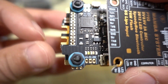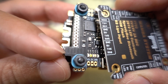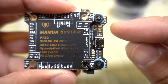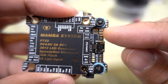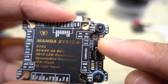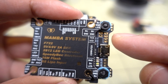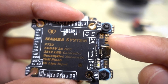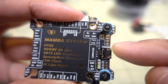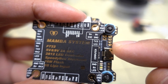The antenna — it looks like a little squiggly line — is the antenna for the Bluetooth adapter that's built into the flight controller, which is kind of cool. On the right side of the board you've got your USB port, 9 volts out, and 5 volts out. The pin on the top left is 5 volts and the pin on the right is 9 volts, so there's a 5V 2A regulator and a 9V 2A regulator on this board. The 9 volts is for certain cameras and video transmitters where higher voltage helps with video noise. You also have TX3 for smart audio and video out from the OSD to your video transmitter.